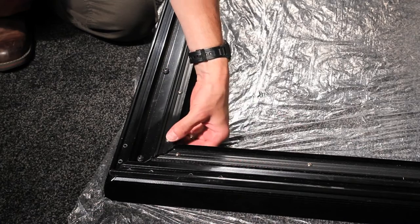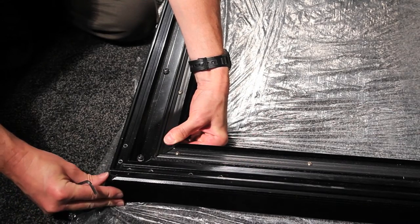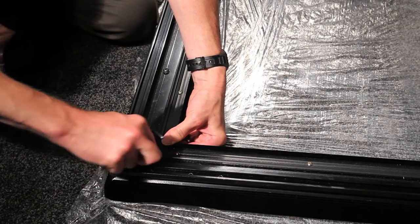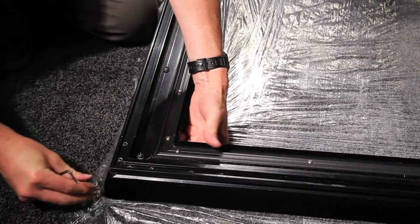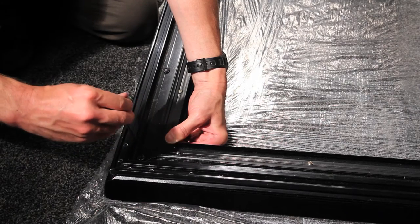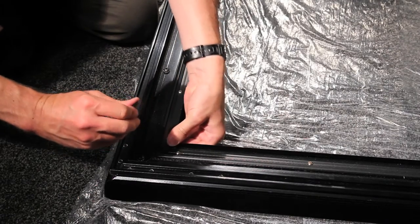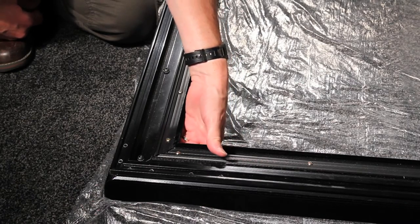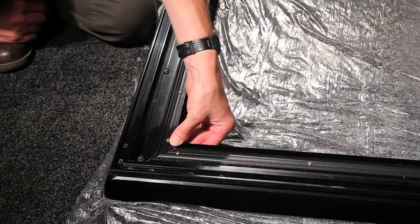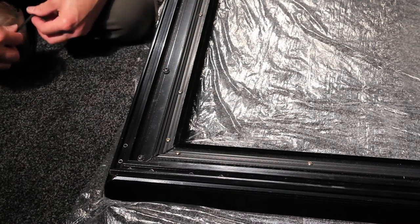For the assembly of the frame on the corner side, we recommend that once you've got the corner brackets in and the frame loosely assembled — with the M6 bolts just in a few turns — support the frame with your hand from underneath and carefully tighten the two corner screws. Before going any further, run your finger underneath the frame on the inside to feel that all pieces of metalwork line up nicely and smoothly. It's worth checking the corner before you go ahead and tighten all four screws properly.